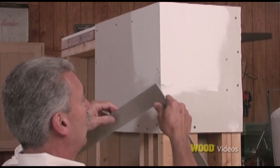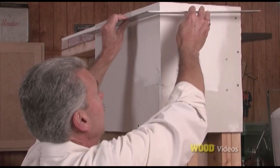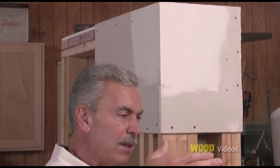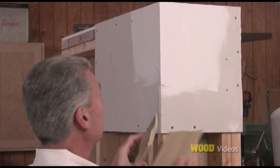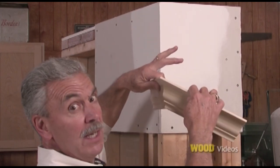With your framing and drywall work, the corner is nice and square. But as we add the bead and the mud that forms that corner, you're going to find that those corners normally aren't square. Once you get past the edge of that mud, they are again. It's very hard to cut miters that have that kind of sweep embedded into them. So the suggestion is, put your miters together at 90. Set your nails way back from that corner and just glue these together.